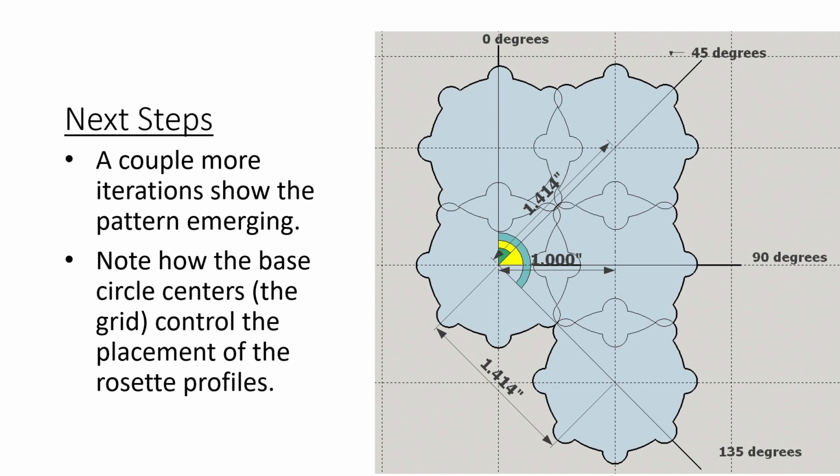Go to the second, we'll just do a couple more. The second center, here's your distance. You had your angle from the table. You've rotated it back the same amount on the rosette barrel worm, and it's complete. And you've established an overlap. Then you continue around, just taking the values from each row on the table.